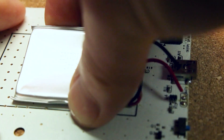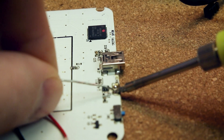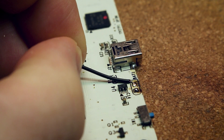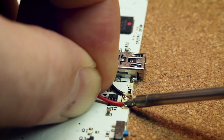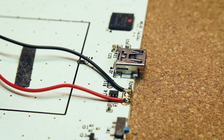We're going to peel the battery off carefully. Then apply a little fresh solder to the board — just a tiny bit. Touch your negative wire to the board where the negative came off. Done. Take your red wire, touch your soldering iron to it — pre-tinned with just a little bit of solder — hold it there for a second, and done.